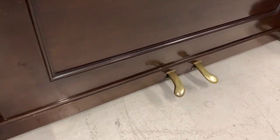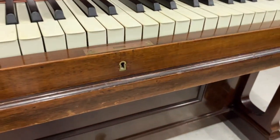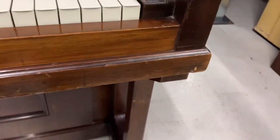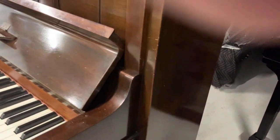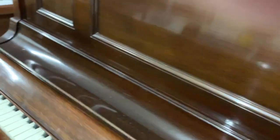If it was a stock piano I think we'd fill the veneer, because if most of it's still there — you can see the rest of the front here — we need to make it good but it doesn't need re-polishing. At least if it was a stock piano we wouldn't re-polish it. Obviously anything can be done, but in terms of economics it's quite expensive to re-polish, especially when it looks so integral. There's no fading, no difference in colour. If I push the lid down it's almost the same colour — perhaps slightly darker there, but really in very, very good condition.